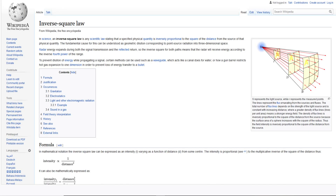Shortwave can propagate against both the ionosphere and the ground, which means it follows the curvature of the earth and doesn't have range limitations. You could be listening to a transmitter on literally the exact opposite side of the planet. However, due to some complicated math, the signal gets exponentially weaker as you move away from the transmitter, which means the signals are very weak.